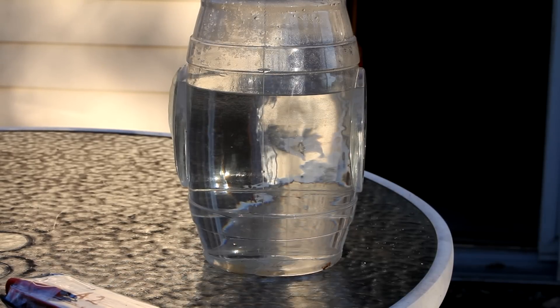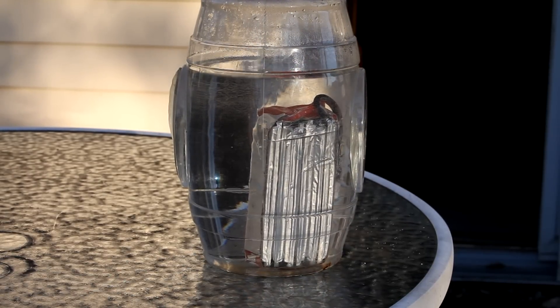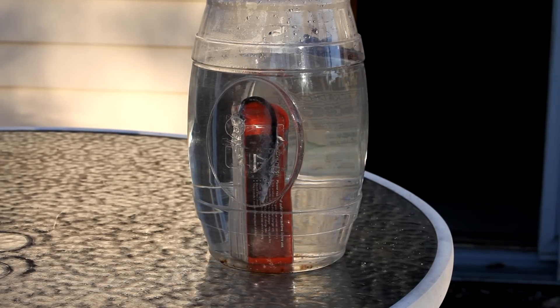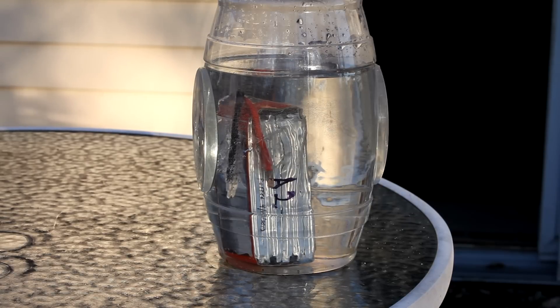We're going to proceed with the salt brine discharge method for trying to make a LiPo pack safe. We're going to let the pack discharge in the salt water brine for about three days, then return to the pack, cut the protective wrapping off, and measure the individual cell voltages. As you can see right now, we have some type of current flow through the brine solution from the negative terminal across to the positive terminal, which isn't fizzing. My assumption is the terminal ends will oxidize over — hopefully not before the pack fully discharges — but we shall find out in about three days.